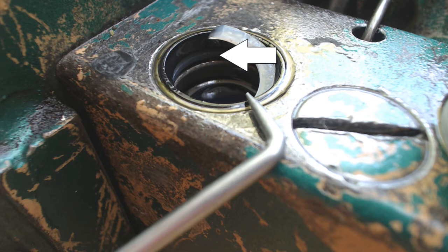Now for my still experimental portion of the video. If you look where the arrow is pointing now, you'll see an o-ring sitting just below the seal but above the boss. This o-ring is something I'm tinkering around with - it seems to be working quite well. It's a 15/16 by 1/16 cross-sectional diameter. It sits in underneath the seal in the seal area but above the boss, separating the o-rings. Once this o-ring is in place, I'll take the seal and drive it down all the way in the bore so the seal metal bottoms out, sealing the o-ring against the seal and against the actual boss in the bore. I'm doing this to provide a little extra seal to make sure no air can get past or around the top seal.